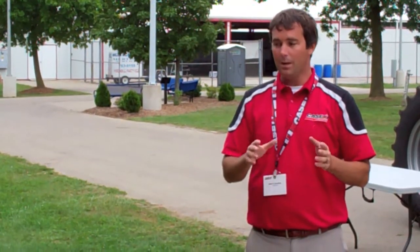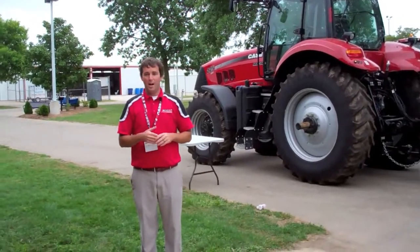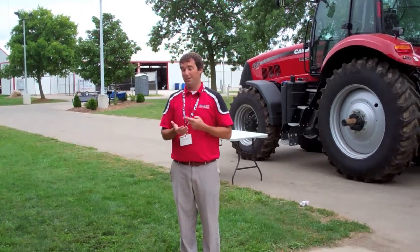be 3-4 hours, up to 6-8, but sometimes very narrow on when you get that optimum moisture of the hay. If it's going to be 17-18%, it's going to be too wet, it may not keep, but if you get down below 12%, leaves are going to fall off and you're not going to be harvesting very high quality hay. So when you talk about maximizing that baling window, we want to make sure this machine's getting as much done and also is always running during that window.